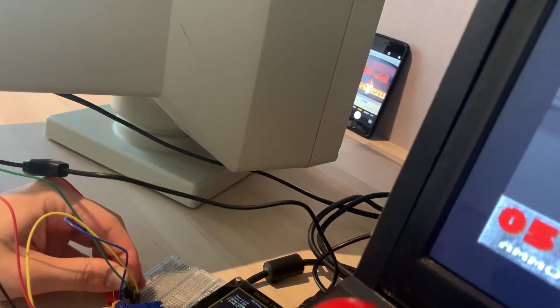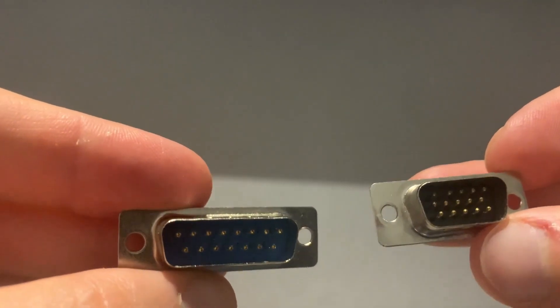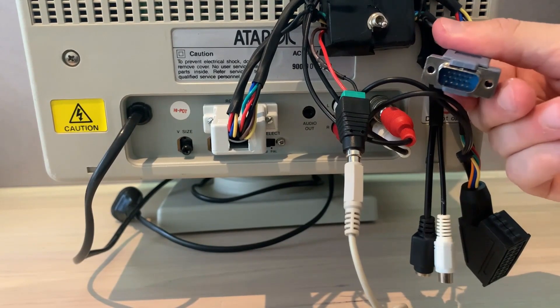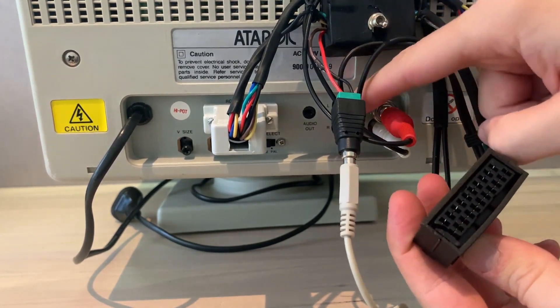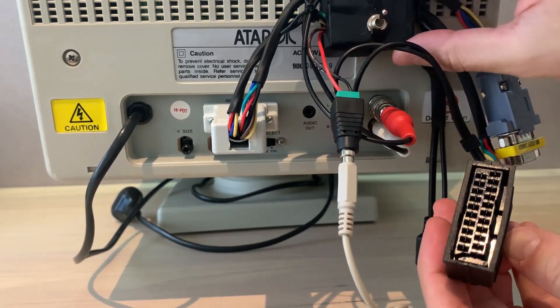With the DB15 connector all mapped out, my breakout cable has finally reached its final form. I have a standard VGA DB15 connector for RGB-HV and RGB-S, which is really convenient for hooking up the MiSTer. RGB-S and stereo sound can also be passed through the female SCART port with a toggle for the sync stripper. And there's external power input to power the sync circuit for backup.